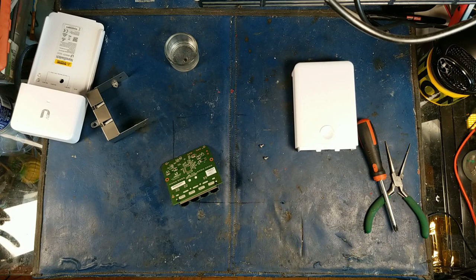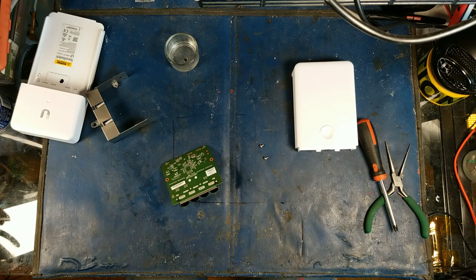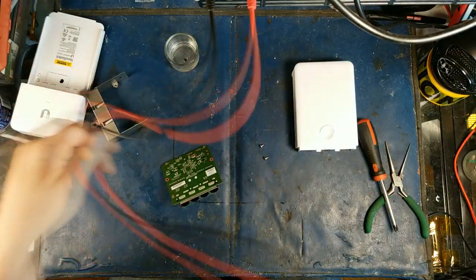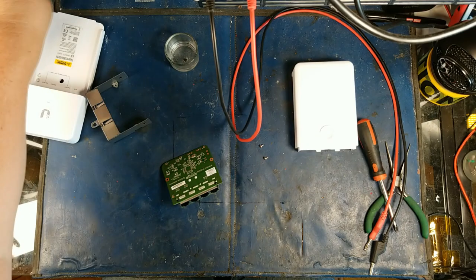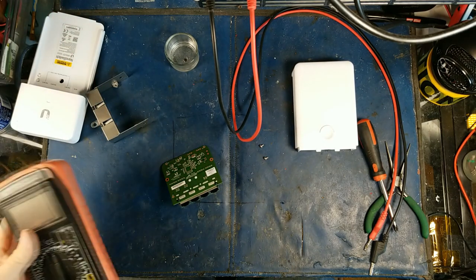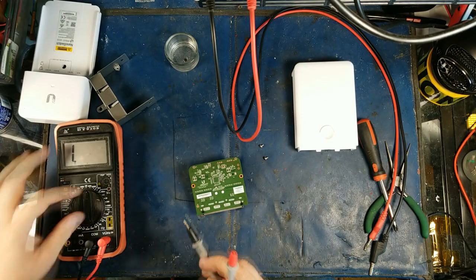So I want to try that. Let me do a couple of little tests here. I'm not going to do exactly 24 volts just in case I screw something up. Let me get my multimeter and figure out which one's negative, because your negative is usually referenced to ground on most things.